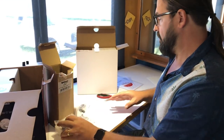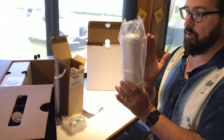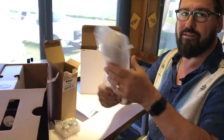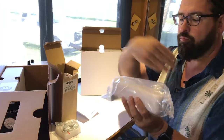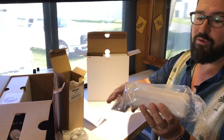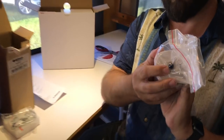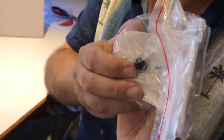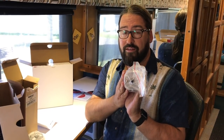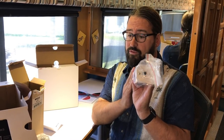Now it is put together in a new kit, and it is omnidirectional. This is also an omnidirectional antenna that needs to be installed vertically — you cannot install it sideways to get a low profile. These antennas broadcast in a donut shape out from them, so if you've got it lying flat, your donut's not going where you want it to go. On the bottom it's got an F connector, which lets you use the same sort of antenna wire that cable TV or satellite TV systems often use, so you might be able to use wires you already have.